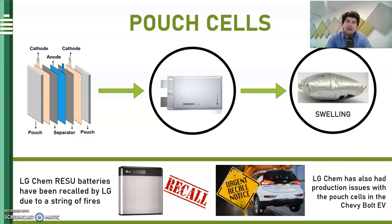It does however have some downsides when used in more stationary packs such as home energy storage or an electric vehicle. Since the pouch is not a rigid enclosure, special attention has to be paid to the overall battery structure to ensure that the individual cells are not able to expand over time during charge and discharge. In addition, the pouch cell has extra safety concerns during a short circuit or an overcharge event where the buildup in pressure can cause the cell to swell. This poses a serious risk if the pressure releases at once, while prismatic and cylindrical cells have built-in vent mechanisms to prevent mass buildup of gas inside the cell.